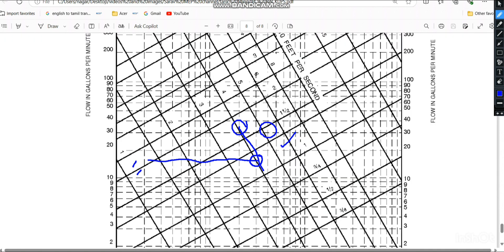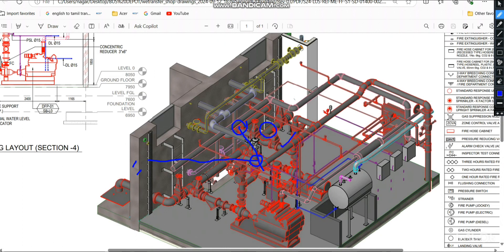The intersection point is slightly higher than the 1.5 inch line, so we must go to the next size up, which is 2 inch. Therefore, the individual pipelines serving each compartment are both 2 inch, while the overall supply line remains 2.5 inch.